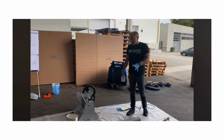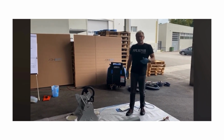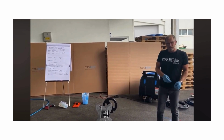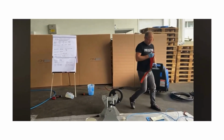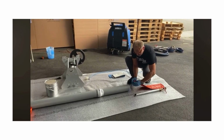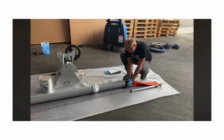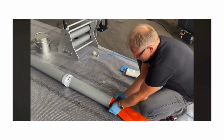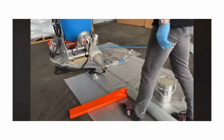But you also have to prepare it, because the calibration hose which is running out here should be covered with a second calibration hose, because when you want to make a cut into the calibration hose, you should, for safety, make a second calibration hose to cover it. And this piece I have here. That means as soon as the calibration hose is coming out here, it should run into this calibration hose. To be sure that it will do it, I just take this piece of liner, put it here in, and then it will easily run into it. Good.